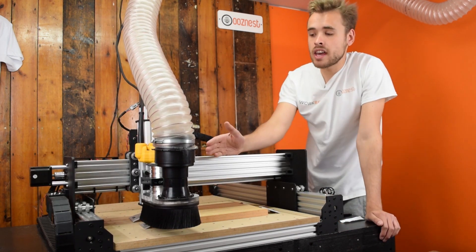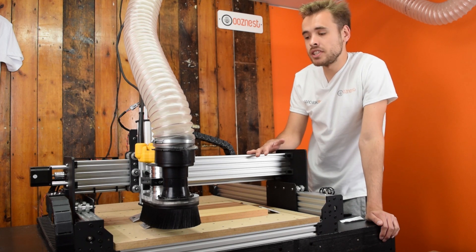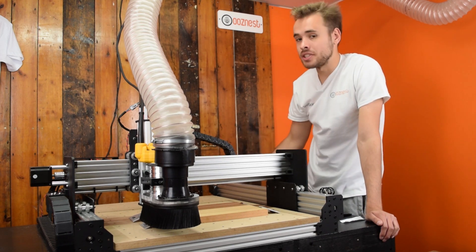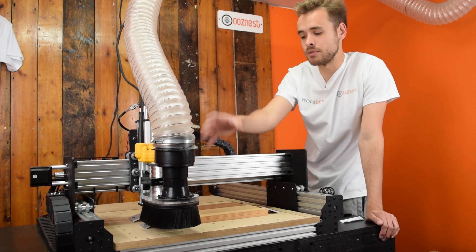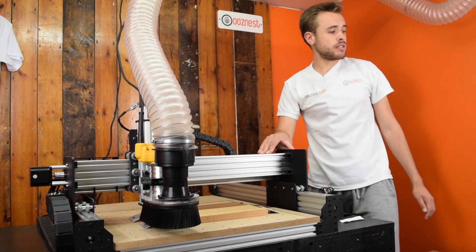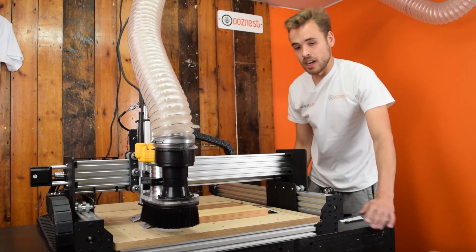So in this case, as I'm already there, I'm going to start the job from here. But in our CAM program, the machine works in absolute coordinate positions. So as we have the Work Position set and the Machine Position set, it doesn't matter where we actually click send the job — it will still work from that position. So we can start over here and it will still work correctly on this material. So I'm going to turn the router on and send the file.